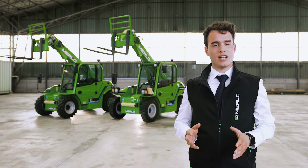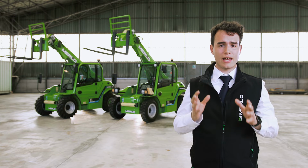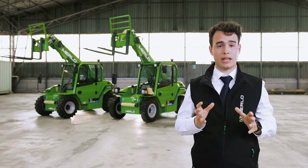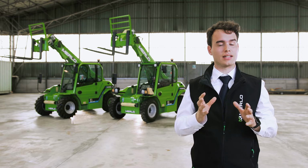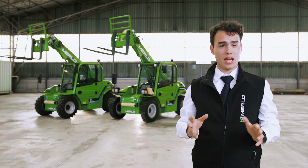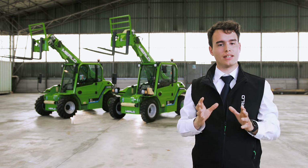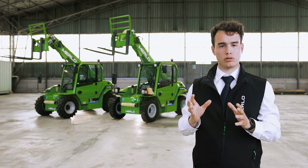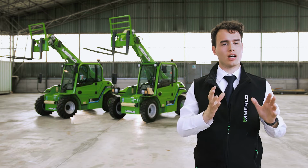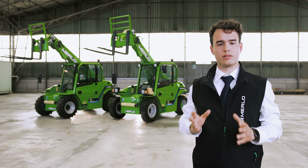We chose the lead acid battery for 4 reasons. It is a robust, well-proven and reliable technology, especially in terms of safety. It is easy and cheap to maintain thanks to the fact that all modules are standardised and easily replaceable. It is fully recyclable. It has excellent performance to price ratio. We tested the machine according to the VDI 2198 standard cycle. The operating range reached 8 hours in continuous duty with 9 hours charging, both using the 400 volt 3-phase wall box and the 220 volt single phase onboard charger.